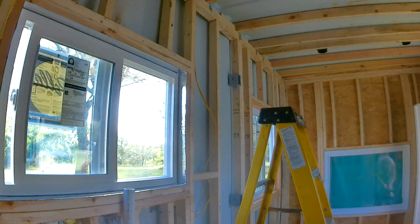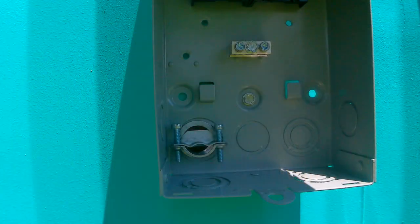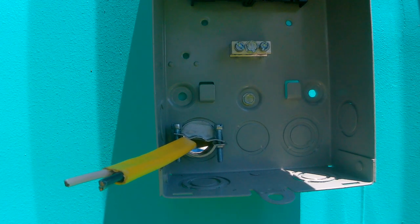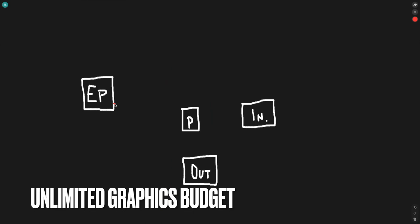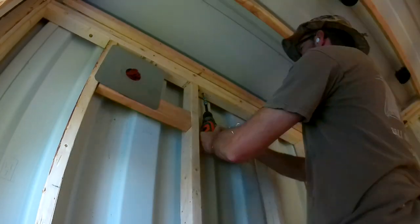The AC unit is on its own wire — its own home run — so nothing else is gonna be on this. This is just for the outside unit. With a split AC you're going to have an inside unit, but it doesn't pull a whole lot of power so it can just be on one of the electrical outlets. You're gonna run from the electrical panel to the pigtail, and then the outside unit runs into that pigtail as well. You'll have a shutoff in there — that's what that little piece is. The outside unit will run into the inside unit, and you'll plug that in. The outside unit and the electrical panel are broken up by that pigtail, which you can turn on and off. There's a little piece you can pull out and flip upside down to turn it off when you need to work on the outside unit.